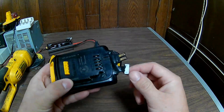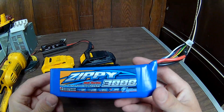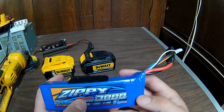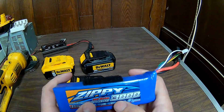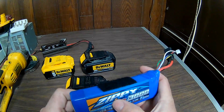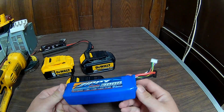The reason I did that is because I got this battery here — it's a Zippy 3000, 3 amp-hour, high-discharge LiPo battery rated at 20C. The 20C is the current discharge rate, so 20 times 3 amps equals 60 amps continuous. It might surge at 30C, so it could almost do 100 amps, which is pretty substantial.